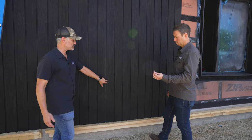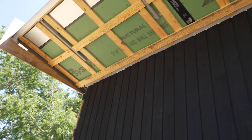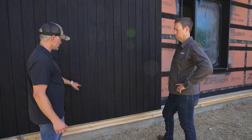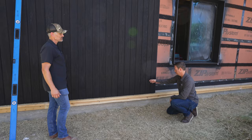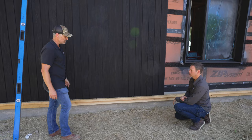We have to line everything up in a jig in order to get those straight lines, because you can't see them. It's a pretty solid application because you've got quite a few fasteners. I noticed that Brian and the crew from Becca put in what's almost like a ledger board - they tap-conned that into the concrete and then attached this on top, so he's literally just setting the boards on top. It's a single board from this ledger all the way up to the soffit. We shot a laser, put the ledger down, and that way it goes fairly quickly.